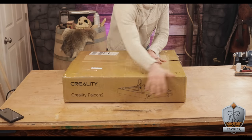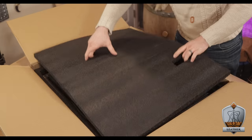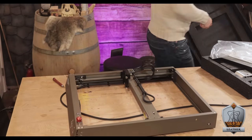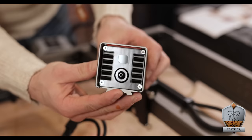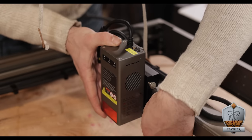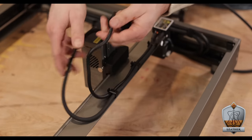It's finally time to get to the moment of truth. The unit I was sent was the Creality Falcon 2. Right off the bat, I was really impressed with how nicely this thing was packaged. It came almost completely assembled — all I really had to do was put on the feet. It also came with this little air pump, which is an integrated air assist that automatically blows air down onto your cut, clearing away any smoke and debris and giving you a cleaner cut while protecting the optics. The laser itself is 22 watts, which is a really powerful one for a diode laser. And honestly, the cable management system — the little clips — is just so perfect. I love when companies take that little extra time to make sure things like that are tight.